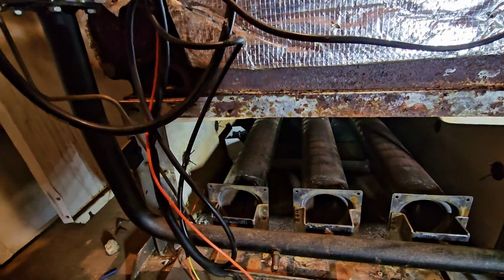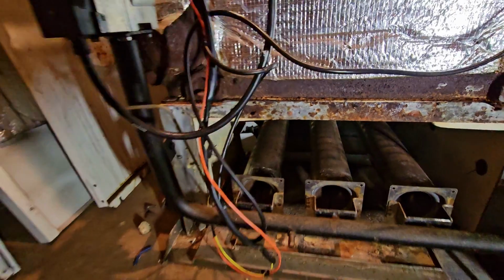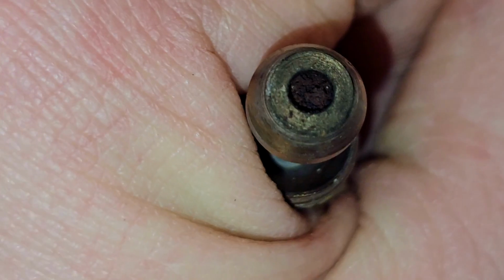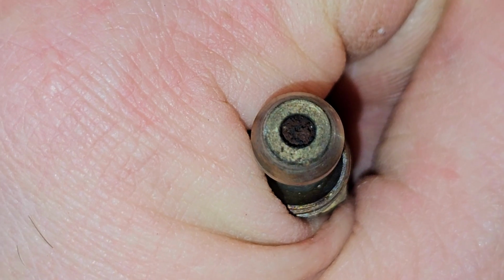The injector looked clean as well, but blow through the pilot tube, clean the injector, try again. I can feel it. I can feel it's on my face, isn't it? Because I can't blow through the pilot tube. So that might be our problem, eh, after all of this. Actually see the debris in it. Look. How did I miss that?